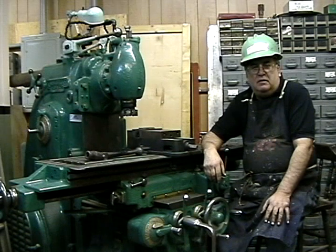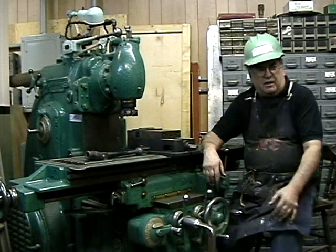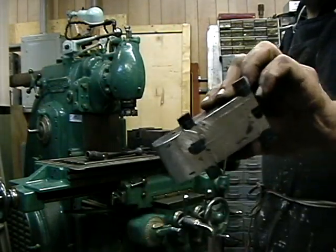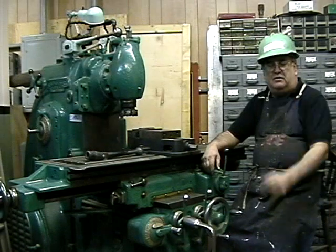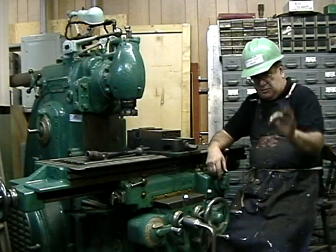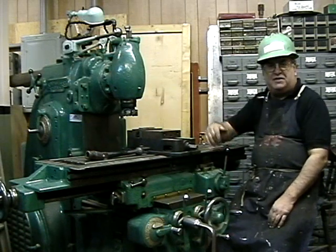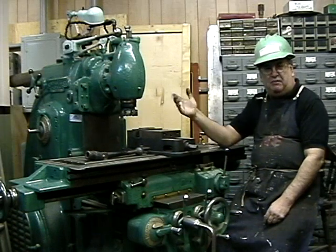Sunday afternoon I've been working on the Stoker engine and I got the body done. I needed a piece of steel 5/16ths by an inch and something by this long, and the thickness is what I'm concerned with. I think I have a piece somewhere, but I got a chunk here that I think is 5/8ths thick — twice as thick as I need — so I figured maybe it's time to try this big mill I got here.